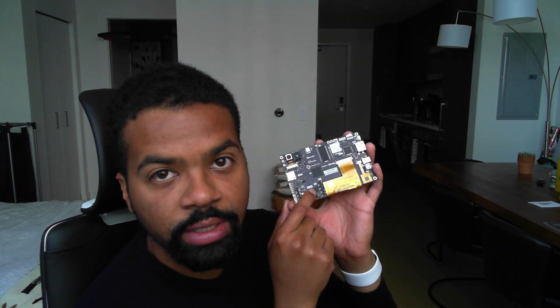We've got an SD card slot that works as normal, with support for FAT16, FAT12, FAT32, and exFAT, along with standard SD cards, SDHC cards, and SDXC cards. We also have 32 megabytes of quad SPI flash on board, just like the OpenMV Cam H7 Plus, so you can store neural network assets on that flash drive without using SD card space.